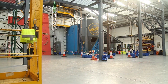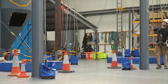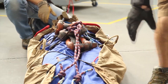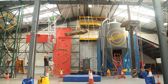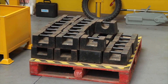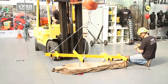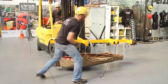The two tests we're going to do today: one is a dynamic test — we want to be certain that the handles and fixtures and fittings of the stretcher will survive repeated, fairly heavy frequency bouncing, as if somebody was being carried at speed across rough terrain. We also want to check that the casualty — in our case a dummy — isn't going to physically come out of the stretcher at any stage. The second test is a static load test; we're going to test it to way beyond what the manufacturer states is the maximum load, to get to a point where we can see there is a good factor of safety on all of those joints.